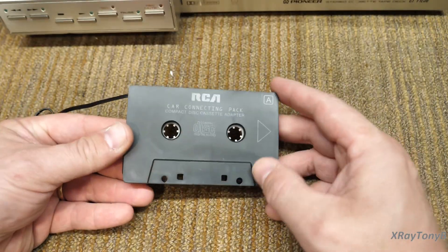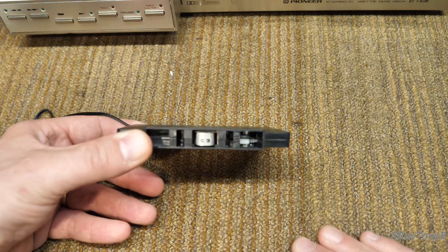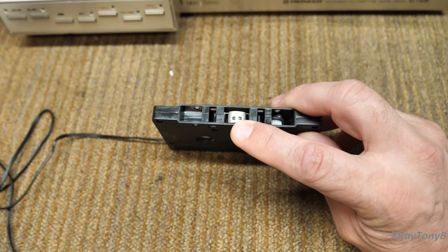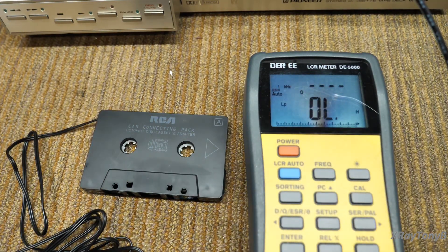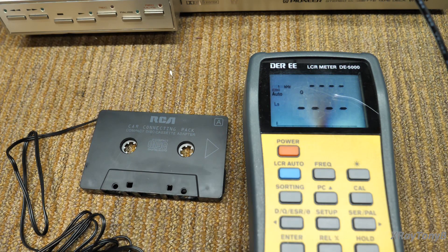Now, you could say we could make one of these cassettes out of machined aluminum — a rigid piece that's very critically aligned — and that would take care of that problem. But in that instance, you would also need the proper signal generator. This tape head has an inductive and capacitive reactance, but it's mainly inductive reactance. I have the LCR meter set up to measure inductance: touching two pins here, this is about 106 millihenries. And if I go to these two, 109 millihenries. If I go to these two, 211 millihenries — which is essentially the two coils in series.